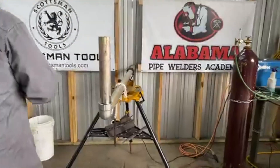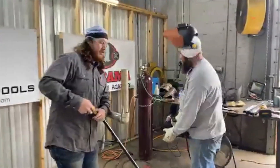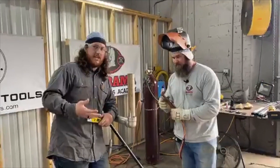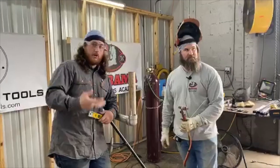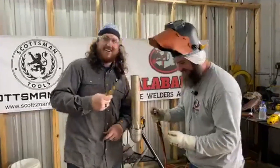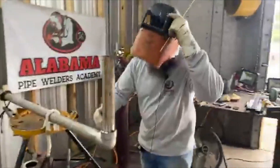Trey, why don't we purge? It's not an open butt. Most sugaring comes from when stainless gets so hot and liquidy to the point on the inside where it can be contaminated because of the oxygen inside. Now, Trey's such a good welder he's not going to get that pipe so hot on the inside — but it does oxidize.